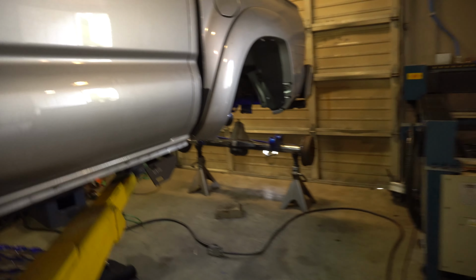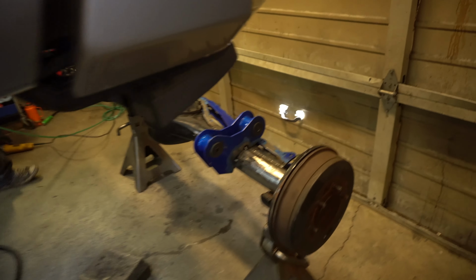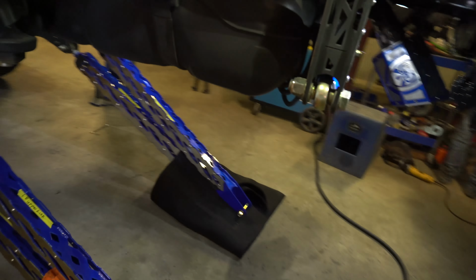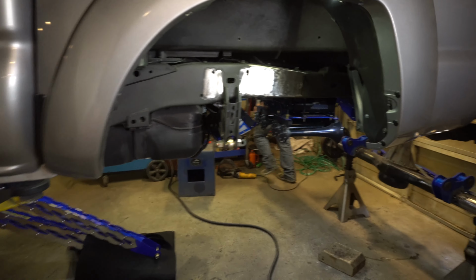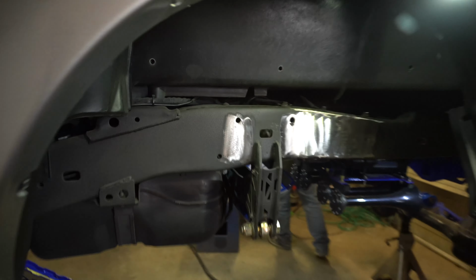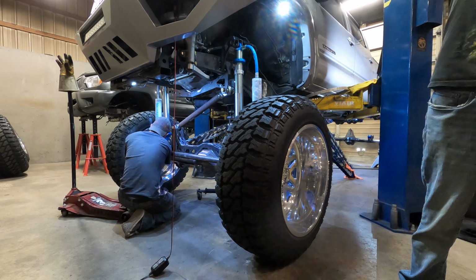And the rear, get over here. We got the axle ready to weld the rear four link mounts on. There, look. So now when the welder gets here tomorrow, he'll get everything welded up and burned in, and then we'll reassemble this and we'll move on to, oh, he's welding together the rear coilover upper mounts as well. Then we'll get those on and then measure for setting up the bottoms, and then we'll move on to sway bars.